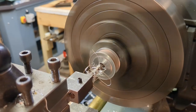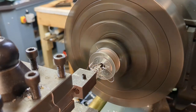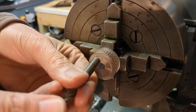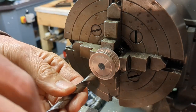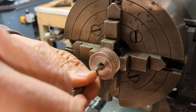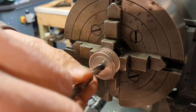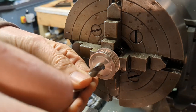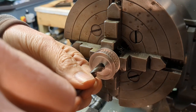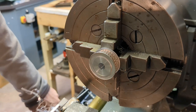So that's taking it to just about the size of the step. It wants to go in on the shank — what about the cutting end? Yeah, so that's going in. I reckon that's 0.3125, so we've got roughly still about two thou to go. I'll take another thou off that and then we'll start to bring the motor shaft up there to test it.